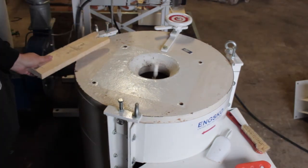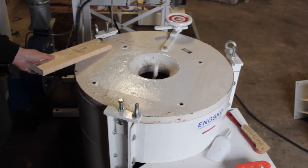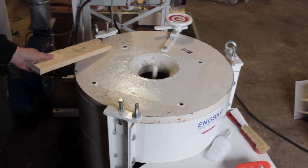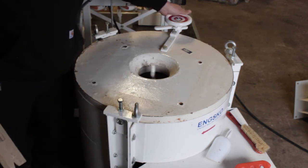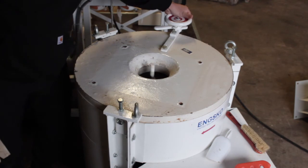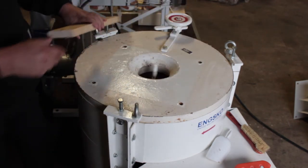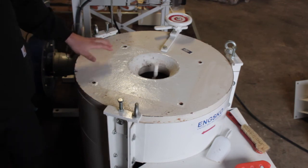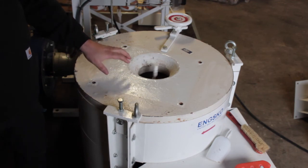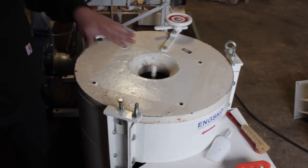When you adjust, less is more — only 10 to 15 degrees per adjustment. After each adjustment you will bring the stones together to where they touch, then take them away and do the procedure again on all three corners to see if you are getting there. When the stone is parallel you will have a nice even sound and not a chopping sound.